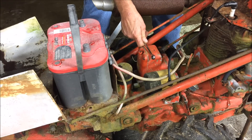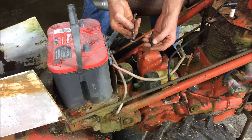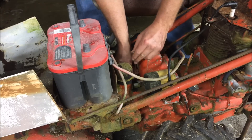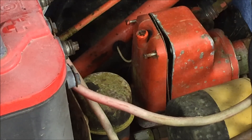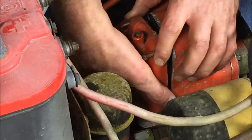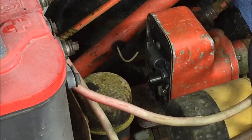Looks like I'm gonna have to go into the magneto. There are four screws that hold this thing on. I've broken them loose already — I had to use a bit and a ratcheting wrench to be able to get in here. It's pretty tight down at the bottom. Alright, I got those little screws out of there. Got a gasket here — it's pretty important to not tear it up. It's supposed to keep water out. There we go. Little bit of dust in there. It looks clean in there. That's good.